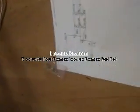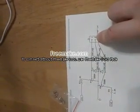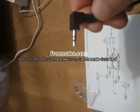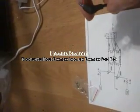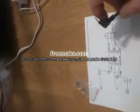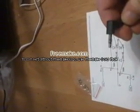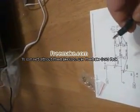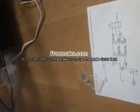Yeah. Anyway, then here is your 3.5mm sound jack, which looks like this. This goes to your line in jack. Now make sure you have a computer that has a line in jack. It'll have a light blue connector that goes into it. If it has one that's mixed, you're not going to have very much luck with it, because I had one that's mixed and it didn't work out very well for me.